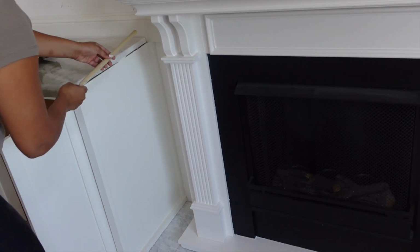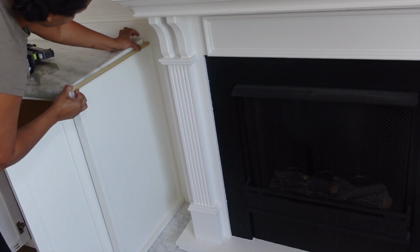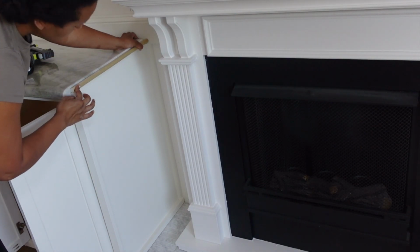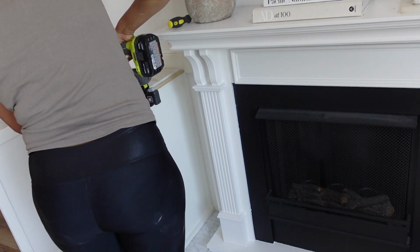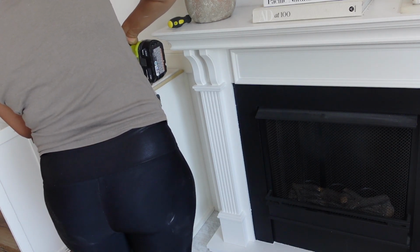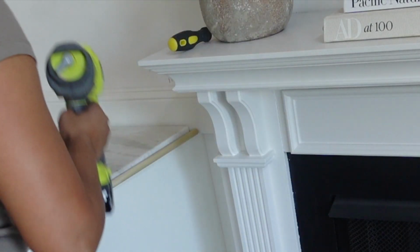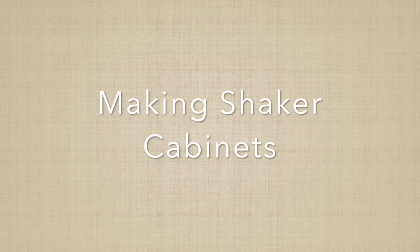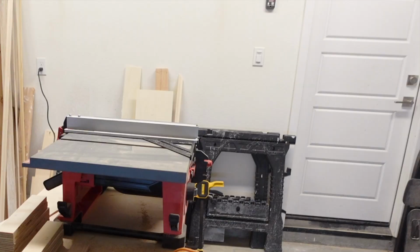Now there is a crack there, and I did go around and fill it with this dowel as a trim, and that also gets painted the same Silk Chamois color. It's just because there was glue on the bottom, there was a bit of a lift, so I just attached that using brad nails. You'll see, maybe you'll be able to tell in the finished product, but it just created a more professional uniform look, and there are no gaps or cracks anywhere, so it just looks flush and filled in all the way around the bookshelf. Trim is a very key step. Do not skip it.